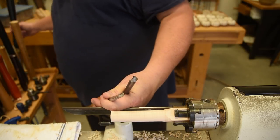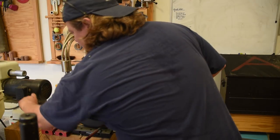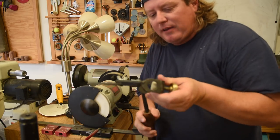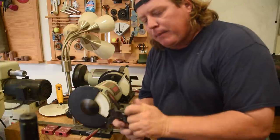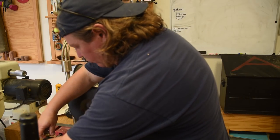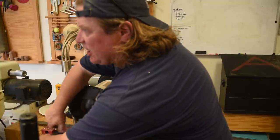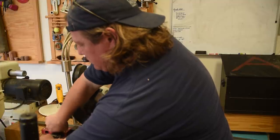So for my main spindle gouge, I come over and I have one of these little one-way jigs. I set it up one time, I've never reset it since that original time. I drop it in here, and pretty much when I'm doing my Wolverine setup, this is the one jig I use for all the same spindle. I drop it into this overpriced hole, which sets the extension out to about 2 inches.